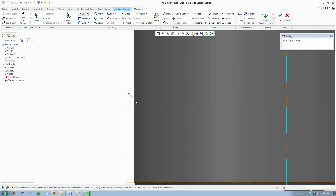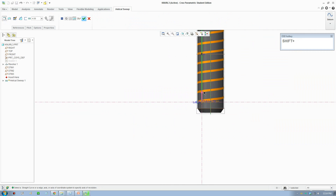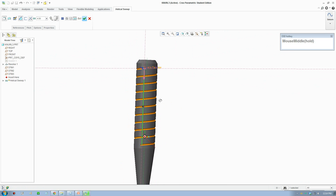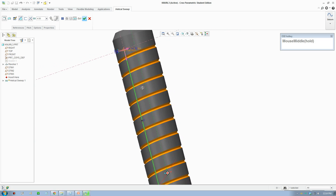Then we'll click this button to define the cut shape. I'll draw a triangle here - we're gonna draw a triangle cut. Make sure we draw this triangle with both lengths the same, so we want to create an isosceles triangle at 45 degrees. I'll make this about 0.5 and bring this in closer to maybe 2.2. Click OK and it creates a sweep. We want to remove material, so we click this button and it creates a sweep.